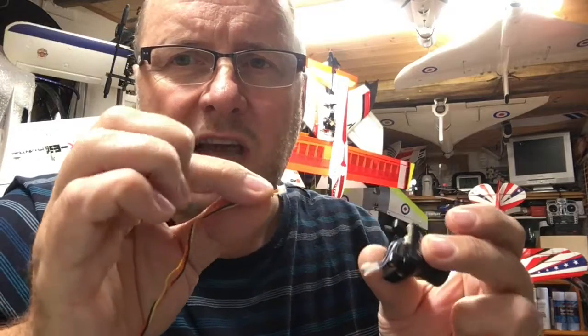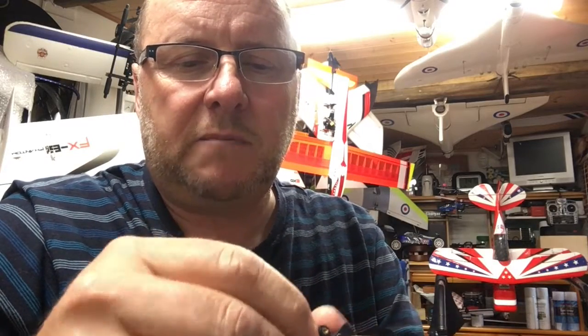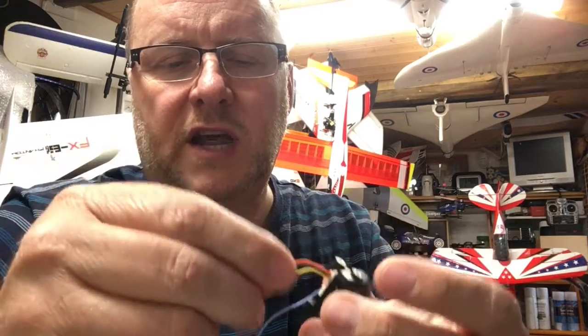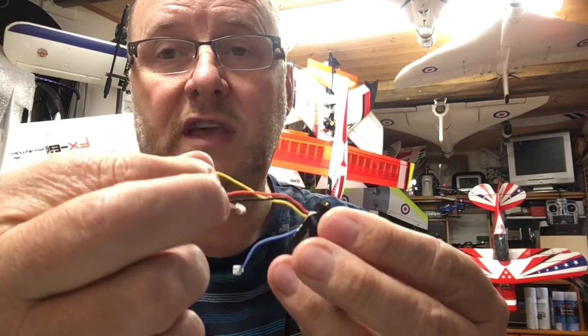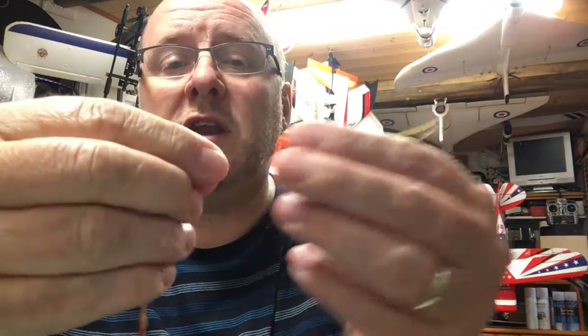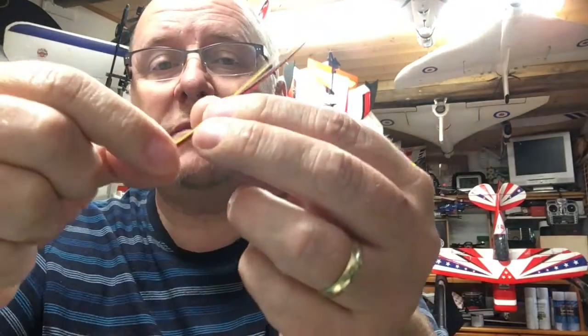A bit of advice: don't keep plugging and unplugging, because if you keep doing that you'll find the plugs will come so loose they'll just fall out. So now this camera, just for demonstration, I'm plugging that in there. I've made sure that the pin convention is positive on the outside edge, the next is ground — there's your supply for the camera — and then you have the yellow, which is the video wire. We're not using audio because that would be the next connection. There are leads you can buy like this that come ready-made with the plugs, but what I like to do is put my own plugs on there. I've got one of these and a set of servo plugs.